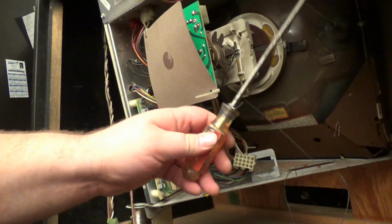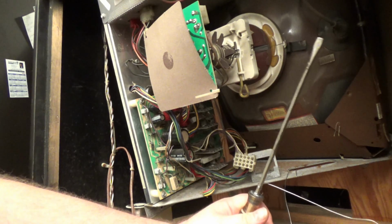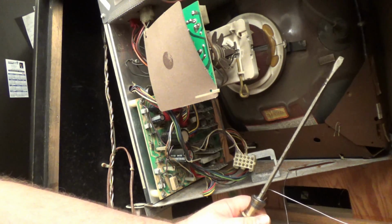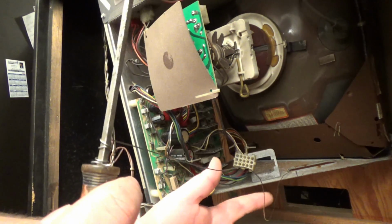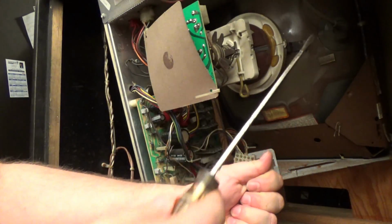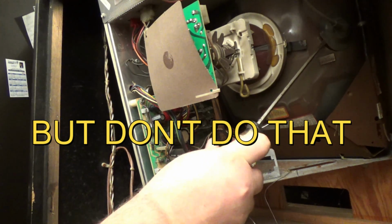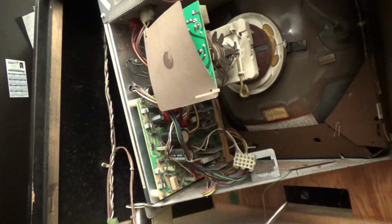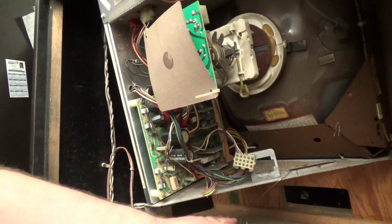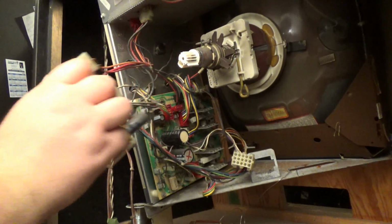Now, I did this exact thing in a video before, and someone was like, "Oh no, you can't do that, bare solder wire," and so on. But honestly, it's totally safe. As a matter of fact, you can hold this bare wire as you discharge it, although I shouldn't tell you that, right? But anyways, okay, so we're discharged. I just touched the anode cup, the anode button in there. We're discharged. Okay, so I'm going to pull off the socket.